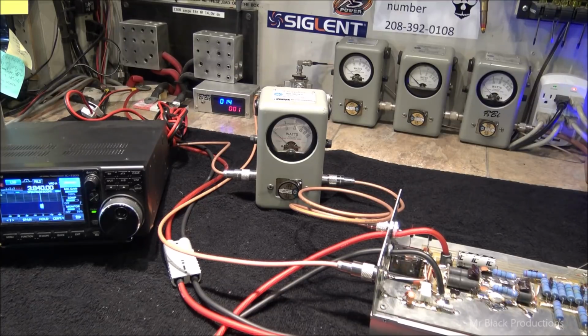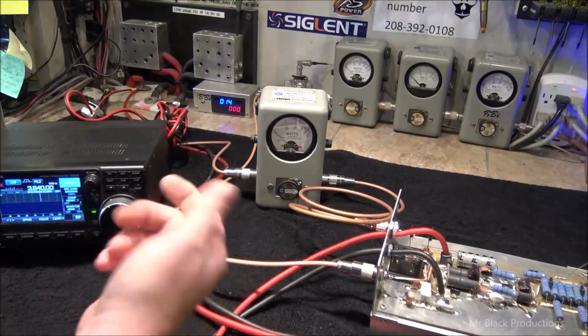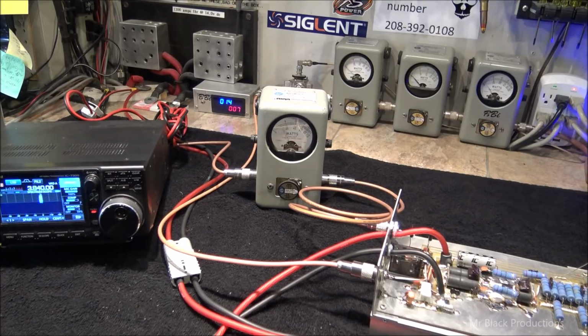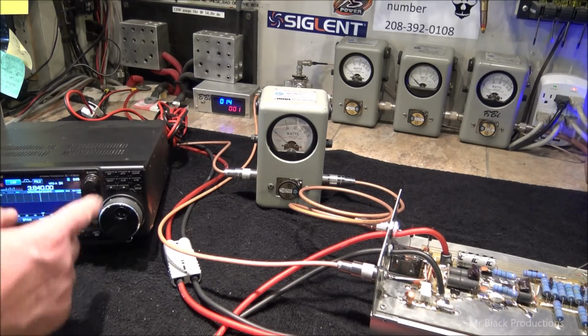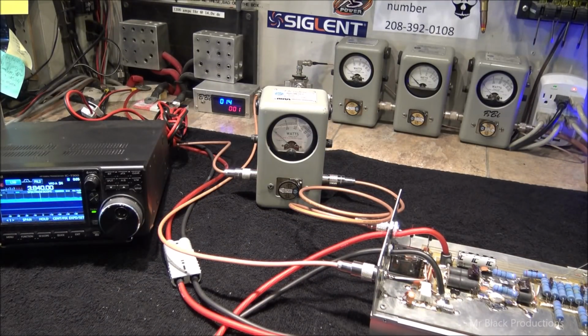So what we're showing you is that pass-through tune. Remember what we just learned about in the last couple segments? We're looking at the amount of power going forward, which is electrically traveling forward out to the dummy load. About 50 watts average, what the radio is supposed to produce. And in reflected power, coming back from the dummy load and all the other meters and passing through the amplifier, not even a watt. That's what we were shooting for. So, with 50 watts in average, all the way across, this is what we got.